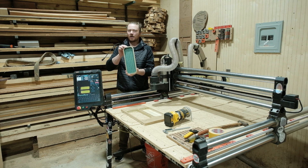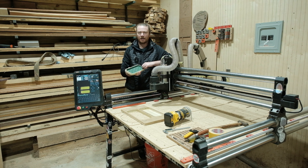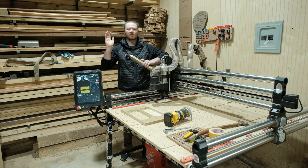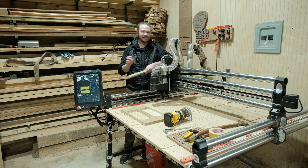Overall, this looks like a much better product. Some of you may have noticed from the time lapse how long the cut took — that's because we're constantly refining feeds and speeds on CNC with me. We have a downloadable tool library for Carveco, Vectric, and Fusion 360, and version 2 is coming in the next few weeks. I forgot I had auto-assigned tool paths and it took about 40 minutes, when this machine is easily capable of doing it in 5.